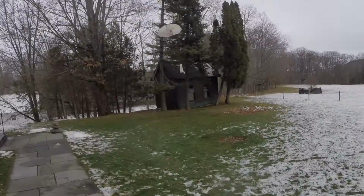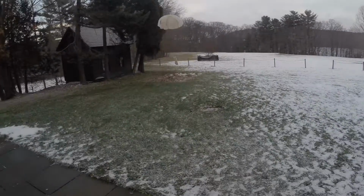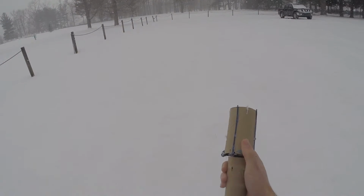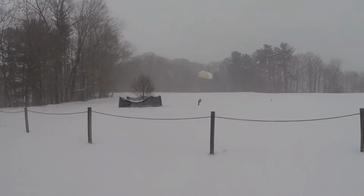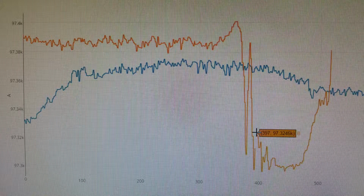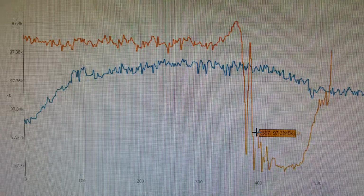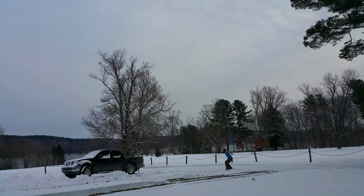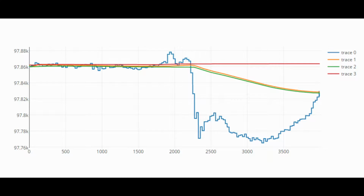I logged the data in a fixed duration loop, so that variations in running speed would not affect the accuracy of the logged data. Then, by using a timed release countdown for my maiden tosses, I was able to get a recording of the data that the barometer would see in flight. The noise of the barometer data makes an exact pinpoint of the trajectory's peak fairly impossible, but luckily, the detection of a throw is more important, as giving the parachute time to unfurl on the way up only hastens its opening. The algorithm only needs to be able to distinguish an actual throw versus a spike in the noise.